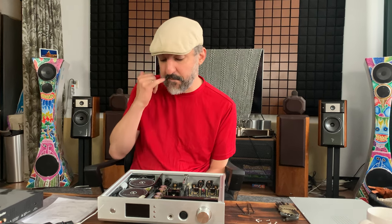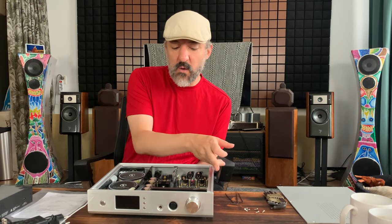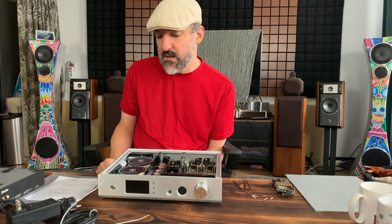See if they fail, see how they fail, see if they can be replaced, see what people think about them, especially when you're on the used market. After you do your diligent homework, go ahead and buy them. But do a visual inspection like this. Look through your capacitors, see that. Look through all of the components. If there's any burnt, charred signs, if this red is suddenly black in a spot, you will want to test that component with a meter, a multimeter, and possibly other things. Don't plug it in. Get it checked out.